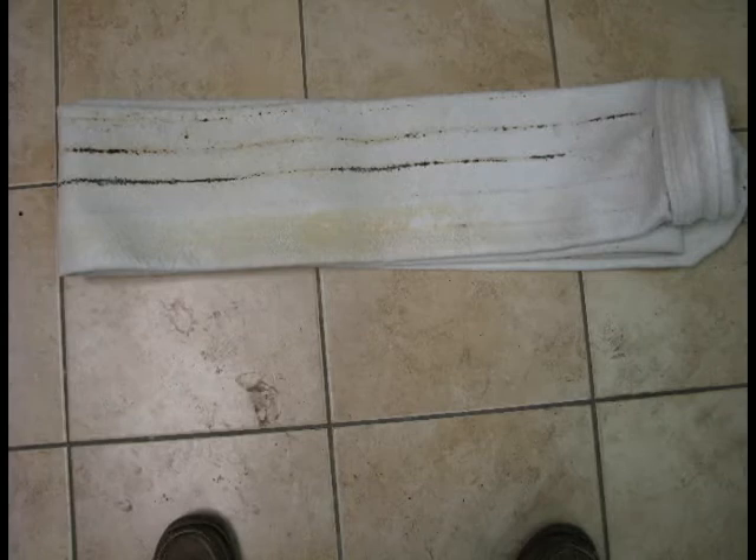This filter came from a grain or milling application. It has no ground wire. What has happened is the actual filter built up static electricity, which transferred to the cage inside of the filter, causing a spark — you actually get a melting of the actual fabric.